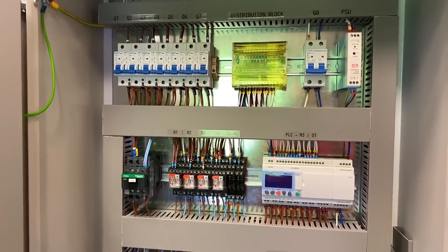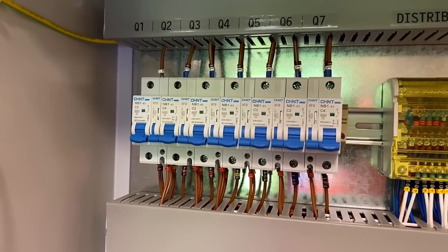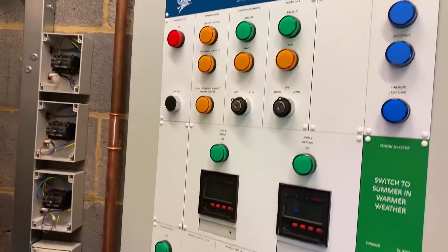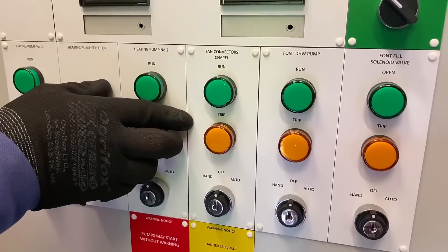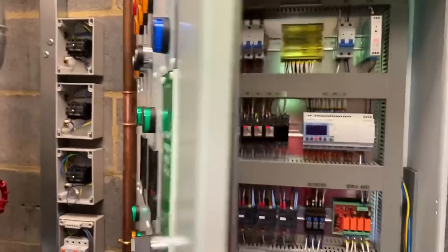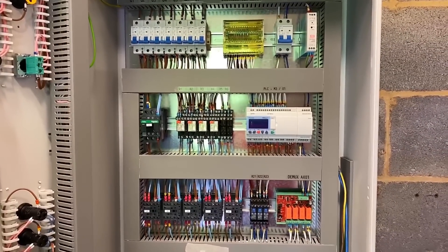It's a beautiful job — it must have been Steve's work. We've got overcurrent protection up here, and we've also got auxiliaries on them which give us our faults on the front of the panel. Just show me that please. You'll have your trip lights, so this will indicate to me what has happened — that the MCB, the overcurrent protection device, has tripped. So in real terms no one's got to get into that panel without a skill level, because the front of the panel is going to tell them everything that's happening behind the panel.